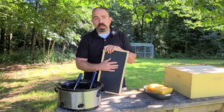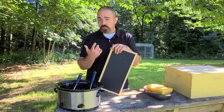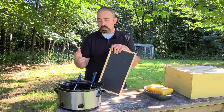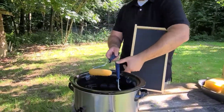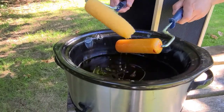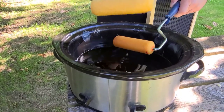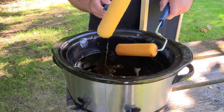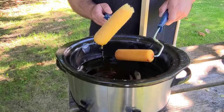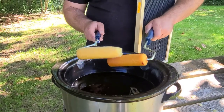You have to find a way to apply it. There are three different ways: you can either use a paint brush, a foam brush, or a nap brush. My preference would probably be the nap brush. The foam works just fine but it doesn't hold quite as much beeswax. The nap one — this happens to be a three-eighths inch nap — holds a good amount, which is why it's probably my preference.